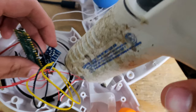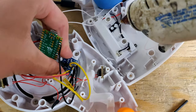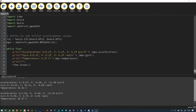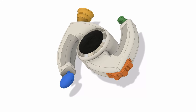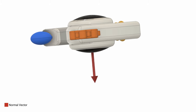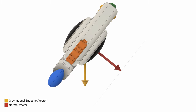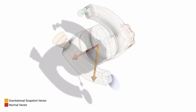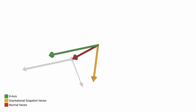If you do choose to stick around, I'm glad, because this is actually pretty interesting. Due to the haphazard mounting of the accelerometer, none of its axes were aligned with the axes of the Bop-It. In order to account for this error, I put the Bop-It perfectly flat on a table and ran a program that printed the accelerometer's output — an XYZ vector of the Earth's gravitational acceleration when the Bop-It is flat. This gives me a vector that comes straight out of the back of the Bop-It, which I'm calling the normal vector. When you tilt the Bop-It to its resting position and trigger the re-zeroing function, it saves a snapshot of the Earth's gravitational acceleration at that point. By taking the cross product of this gravitational acceleration and the normal vector, we can define the x-axis, which is parallel with the ground because by nature of the cross product, it is at a right angle with the gravitational acceleration.